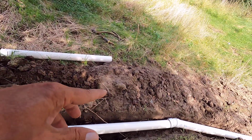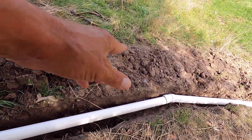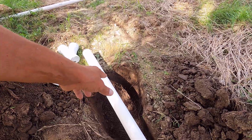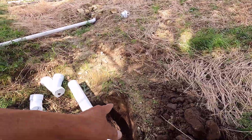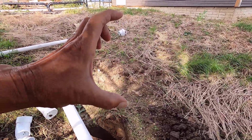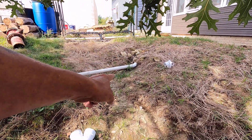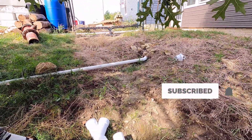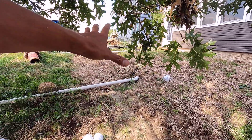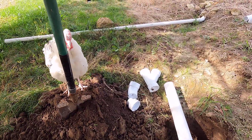The goal with this trench — I need to get a bit further underground. I'm right near the surface there and if I had continued that pipe it would have broke out of the ground right here and gone way up. So I've got to keep putting angles in and keep it in the ground. Once I get this joint on I have to keep both this one and this one in the ground, but I don't want it too far in the ground because I don't want to do all that digging. Hopefully I can get this one maybe six to eight inches under the ground. This one's going to have to have an elbow to bring it back into the ground — that's why I stopped, because I came out of the ground right there. It's not going to be real easy and I'll probably have to get dirt from elsewhere. You could see how this whole area right here is kind of low. I've got this loosely fitted in here — I'll get this cut off and start fitting that elbow there.